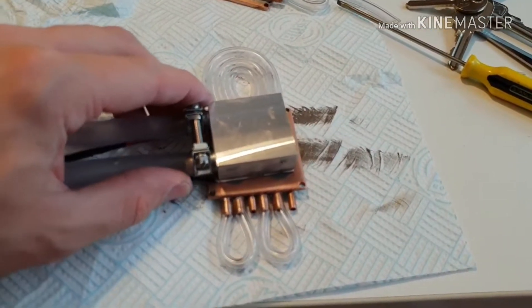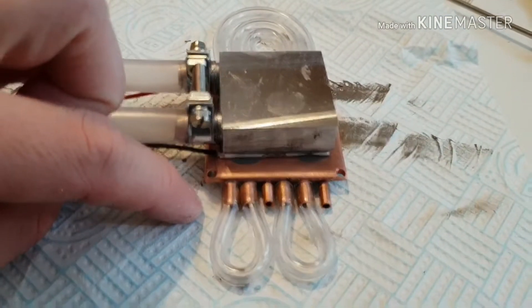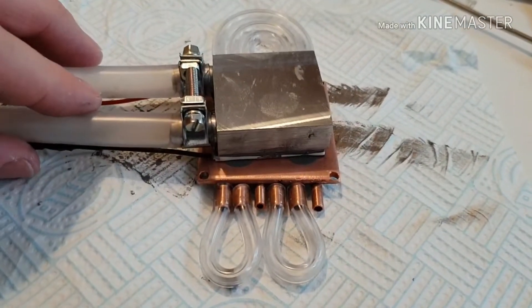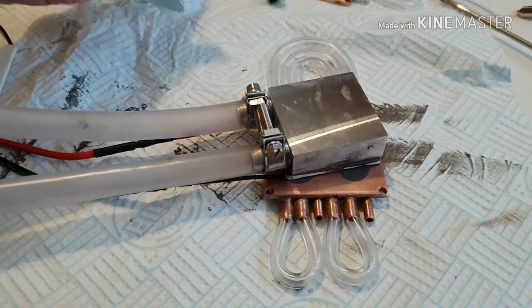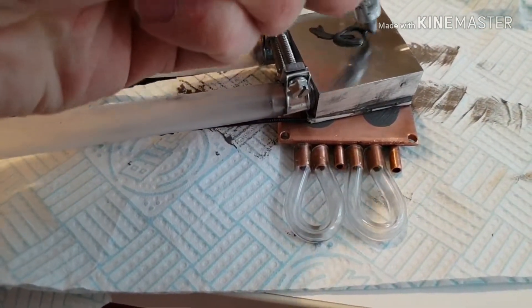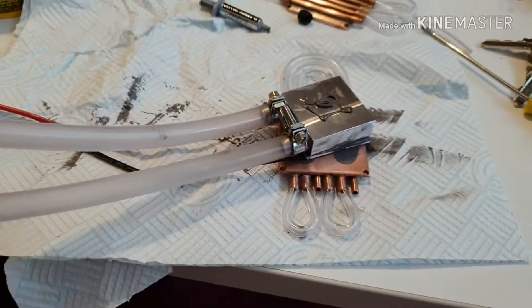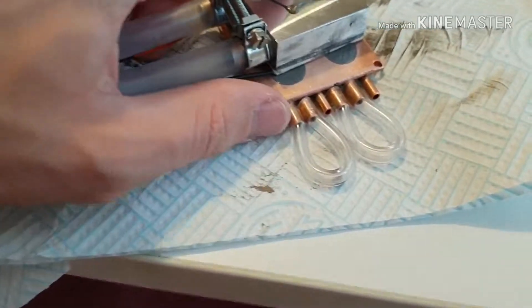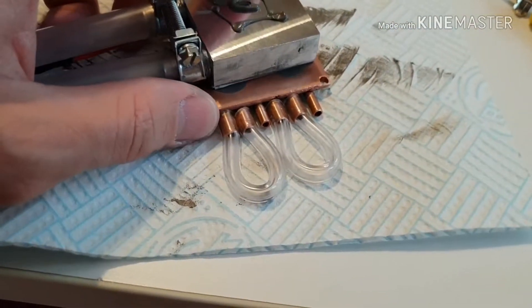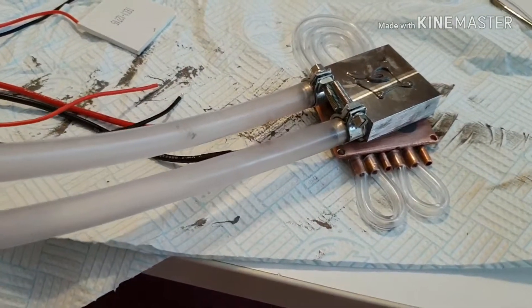So I thought I'd come in with the stack half built and show you how I'm doing this. You can see I've got the good Peltier on the bottom, with the heat sink in the middle, hot side upwards and cold side downwards towards the heat exchange at the bottom. I bought another tube of arctic silver because I was running out of the last tube. We're going to have a blob more arctic silver on here — probably a bit more than I need, but oh well. You can see how the heat sink compound hasn't really spread out like it should yet, but all that moving around is going to help. Universal law of heat sink compound: you always get it on your fingers.